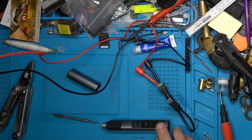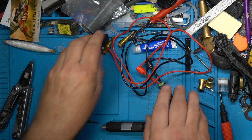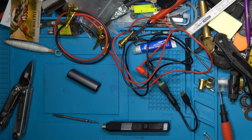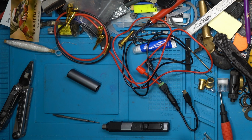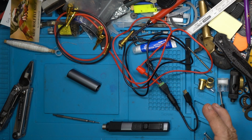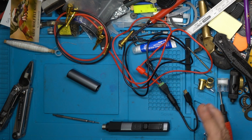amps starting up. So I think what I'm going to try to do next is go ahead and pull the jumpers out for parallel, because I don't think I'm going to need those at all. So I don't need it to be in parallel mode anymore, and I'm just going to swap over to channel 1 because I tend to use it more than anything else. And what I'm going to do is set my maximum current. I think I'll go down to 285 at 20 volts. Let me go ahead and set the voltage to 20 volts at a current rating of 2.85 amps. Okay, so channel 1 is now set. Overcurrent protection is set to 3. Over voltage protection is off. Current is set to 2.85 amps at 20 volts.